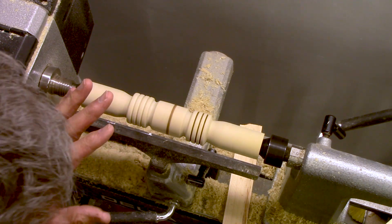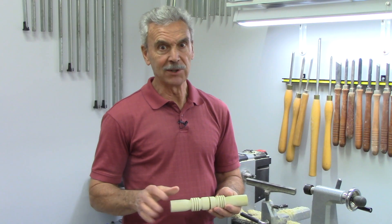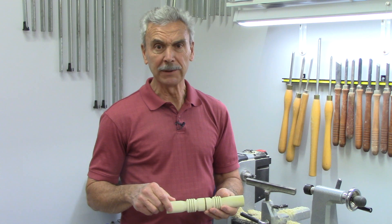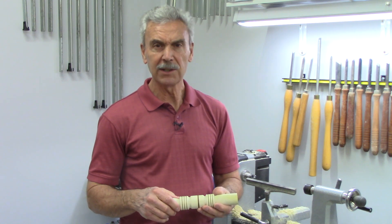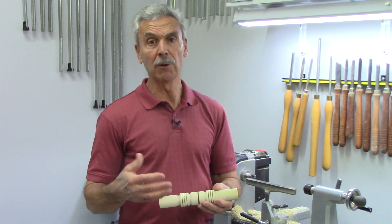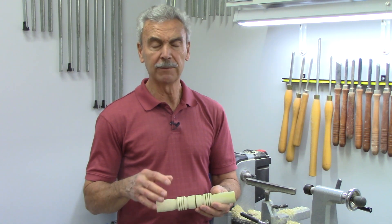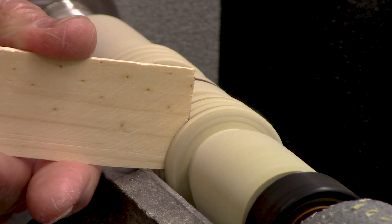We'll also get that nice burn there. That's the idea — it's really fast, provides a nice little decoration, and it's simple. A couple of things to think about: this is poplar, which is a relatively soft hardwood and takes a little bit more time to build up the friction to cause these little burn marks. If you were using cherry or maple, the process would be a little bit quicker. And again, remember — finish all of your final sanding before you do this. These are easy, and I think you'll enjoy doing them.